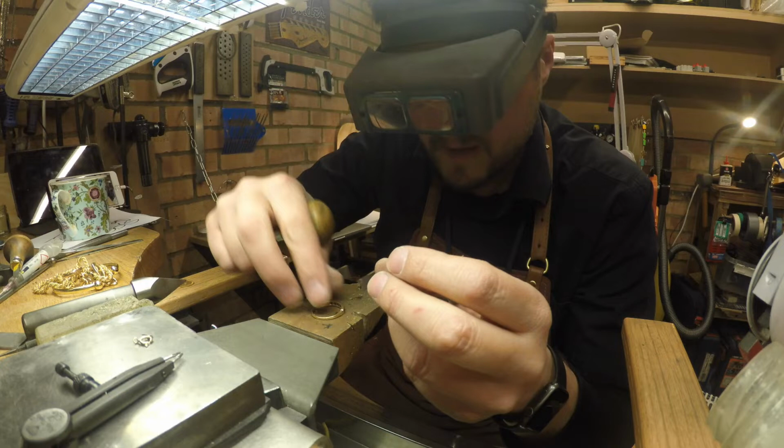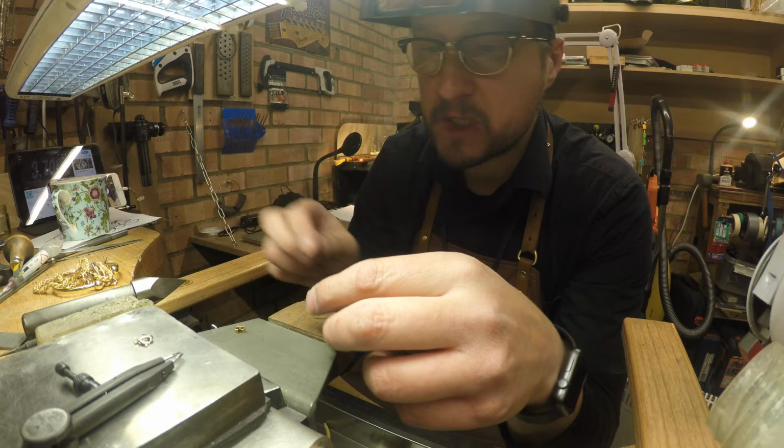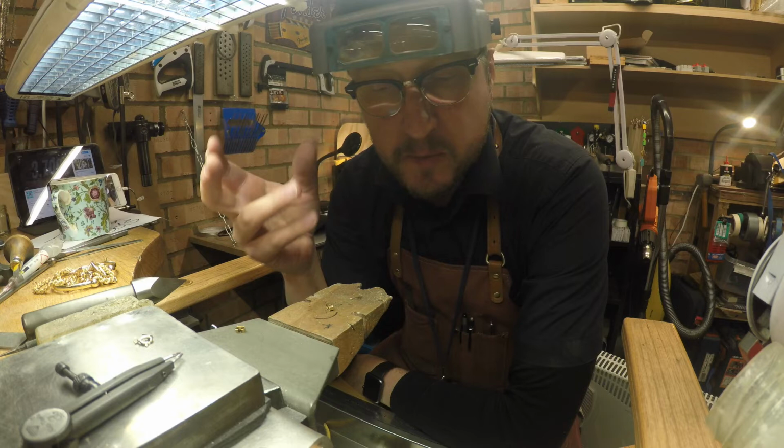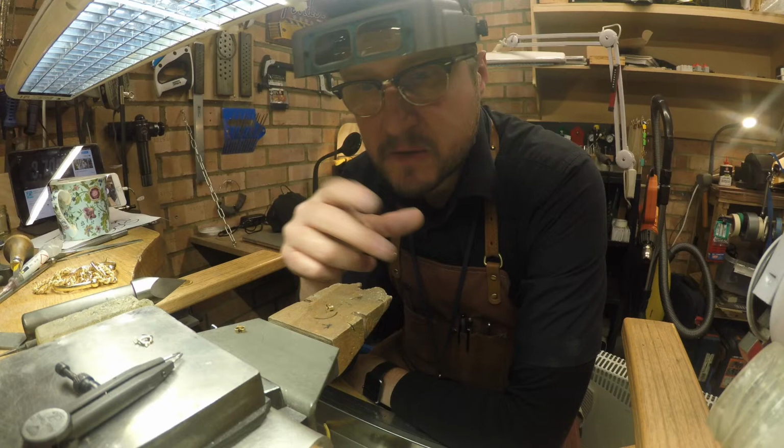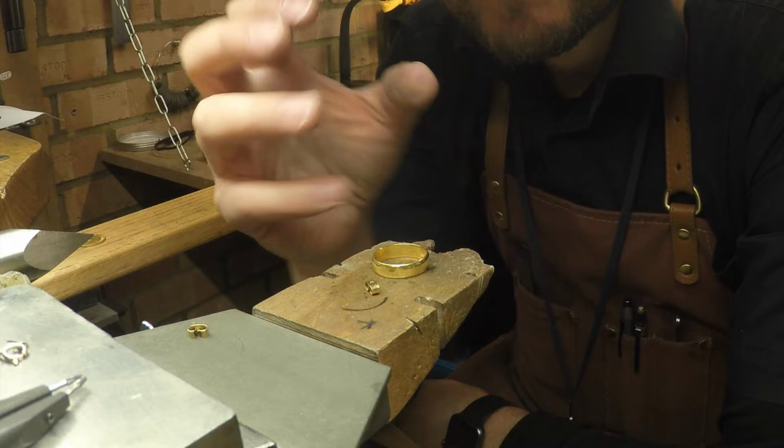And you know what, I'm going to put these things into the ultrasonic machine first before I do anything else, because that's pretty cringy. Alright, while that's running in the ultrasonic right there, I'm going to explain the different colours here. When jewellery gets put into a safe, it starts getting this sort of coppery kind of tinge to it. It's a surface thing only, so you can just wipe it off, you can repolish it and it'll look great again, but they start picking up a bit of tarnish, and that's a telltale sign that this is not 18 karat. Now 18 karat is not going to do that. 18 karat is sort of bright yellow to it, and it's less likely to tarnish.